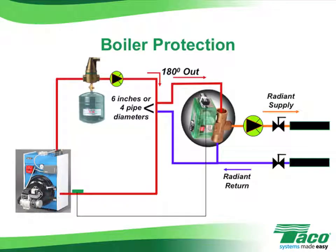The set point I-valve also protects the boiler. No additional programming is required here. When the sensor is installed and wired to the unit, the I-valve will automatically protect the boiler from return water temperatures any lower than 135 degrees.